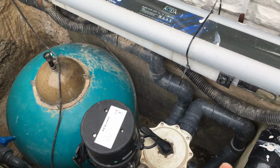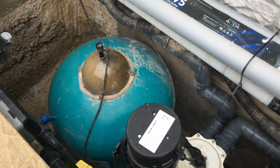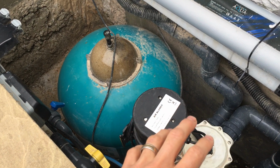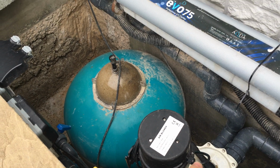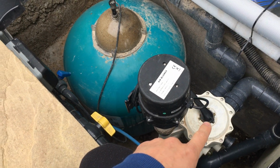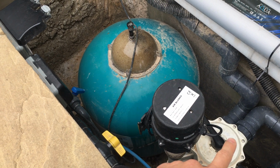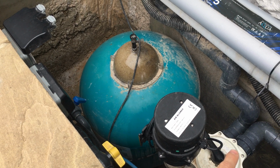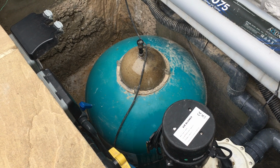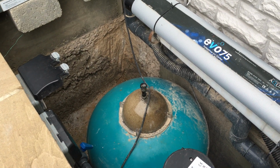As you can see, there's a lot of 90-degree bends I put in to try and keep it at the lowest height possible. My plan today is to take all them pipes out, fit the bypass, and basically I think we're going to reduce it down to one 90-degree bend and 3 swept 90-degree bends instead of 12 90-degree bends. So that combined with the bypass kit should dramatically, or I'm hoping to see an improvement, hopefully, from around the 8,000 litre mark up to hopefully above 10. So I mean, if I can achieve that, that'd be brilliant.